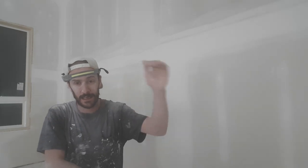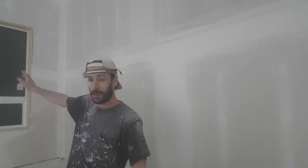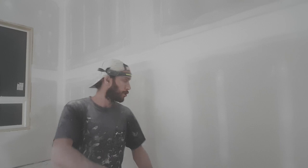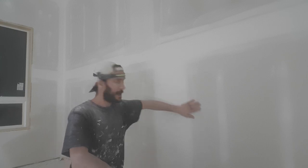It's on the wall. If I can see the tape on the ceiling a little bit, it's not a big deal because it's going to get textured. But on the walls, especially with this picture window back here and another window here — this is the dining room — you want it to look good. I'm going to skim this really tight because it already feels really flat, I can just see the tape a little bit.